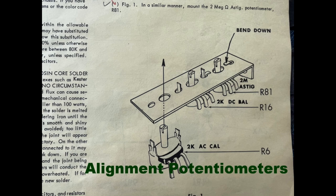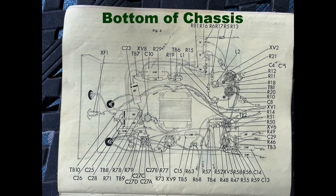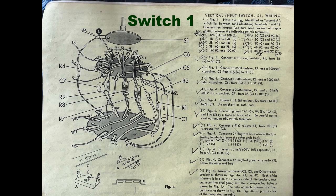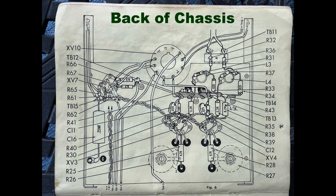I decided to take advantage of this lag time by reviewing the installation manual step by step from beginning to end in order to ensure that there were no shorts, grounds, or errors in the wiring or assembly that may have led to the failure. These images are pictorial diagrams from the installation instructions. I do not recall seeing this section in the online documentation. It seemed like the section was missing in those that I saw at any rate. EICO 460 owners who do not have the manuals may be interested in reviewing or screen capturing this content.